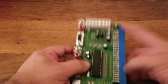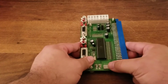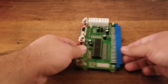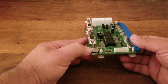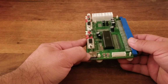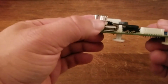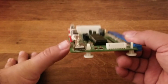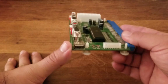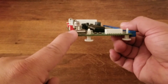Well, you power it on. You put your Jamma game on this side. This right here is for a kick harness. Right here is where you connect the cable that goes from your control I/O board. And that's the board that your joysticks and buttons are hooked up to. Normally, there's a cable that looks like it has a USB 1.0 connector, and that will go into your Chihiro, your Naomi, your Taito Type X. Well, instead of going in there, you'll plug it in right here.